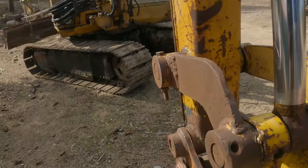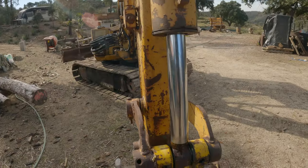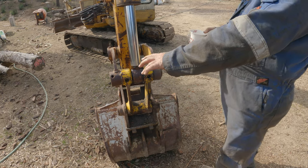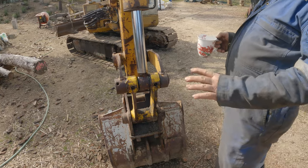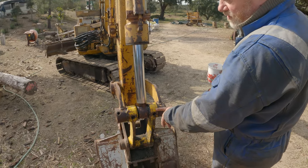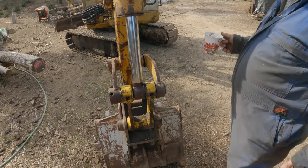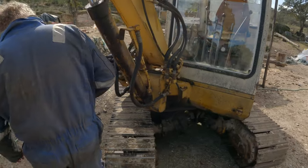At the back there are another two — eleven, twelve. You hear people talking about the bushes: there'll probably be a bronze tube pushed in here and here, and those are wearing parts. On an older machine you'll see a bit of slap — that's the bushes wearing. If you want to, you can take the pin out, press out the old bush and put in a new one; they're not that expensive and it gets you back to as new. If you're buying an older machine on a budget just wanting to do some digging, it'll be fine for another thousand hours or so.